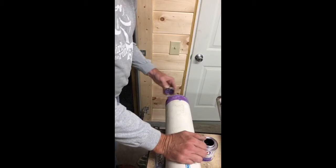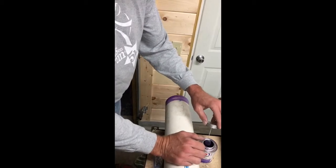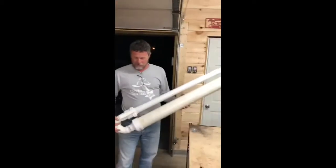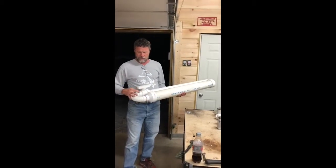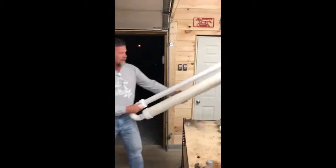No glue, little cleaner. Make sure we have a very good seal so that we can pressurize this bad boy without blowing our heads off — it's always an added bonus. So here's your finished result. Short nipples go in here, your P-trap part goes here, reducer, ball valve, and you are ready to fire.